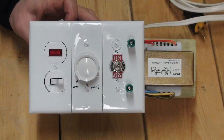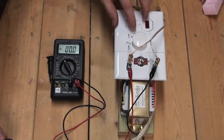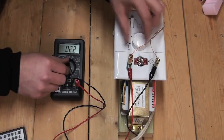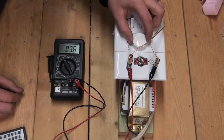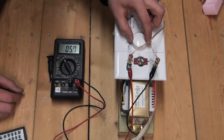Attach a multimeter to test for alternating voltage, then attach the power supply to a cutter. Throw both toggle switches, then gradually increase the dimmer switch. Set to circuit A, this applies 6 volts to the cutter. Using the dimmer switch, you'll be able to fine-tune lower voltages, which becomes important when you're dealing with a large gauge nichrome cutter. When turned to 100%, you'll notice that the power supply achieves near 6 volts.